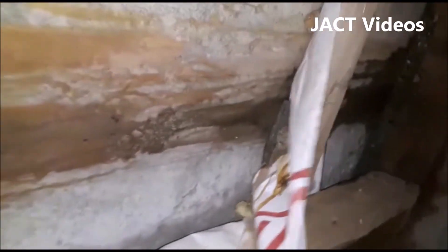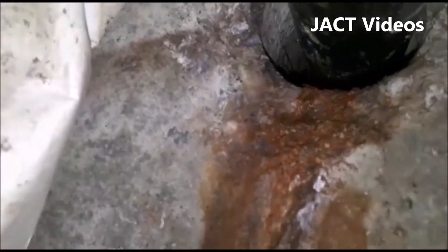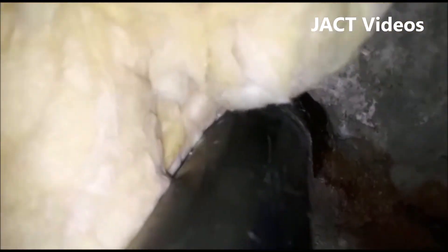As you can see, there is a dark rusty stain on the wall, which tells me that it is the sump pump ground water running along the wall, not clear rain water. I tried to see if there was a crack in the drain pipe, but I could not see anything from inside the house. Whoever did the plumbing did not put any sealant from inside the house — I can see all the way to the other end of the hole. It is for sure sealed from outside of the house, but not the inside.